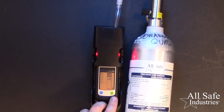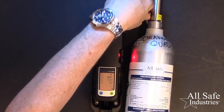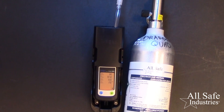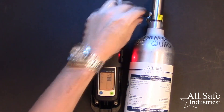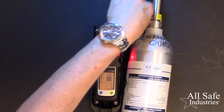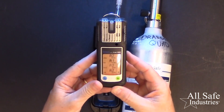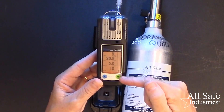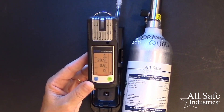Select the bump check icon and then press the yellow OK button to start the bump test. Turn the gas on by turning the knob on the regulator until it's all the way open. Keep applying the cal gas until the display shows OK on all the sensors. Once you have OK on all four sensors, press the OK button on the meter. Turn off the cal gas and remove the meter from the calibration cradle by pressing the release tab. You can exit the quick menus by pressing the blue button. You'll notice that the sensors are still responding to the gas — hit the OK button to silence those once they've dropped down far enough, and then all sensors will drift back down to zero, except for the oxygen sensor, which should read 20.9%.